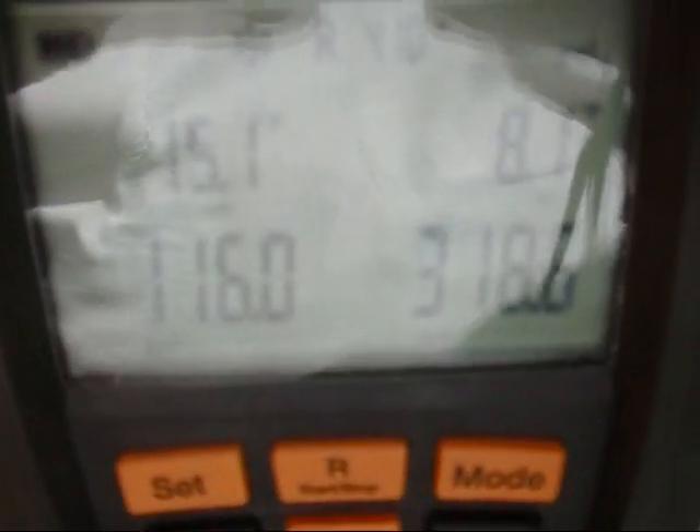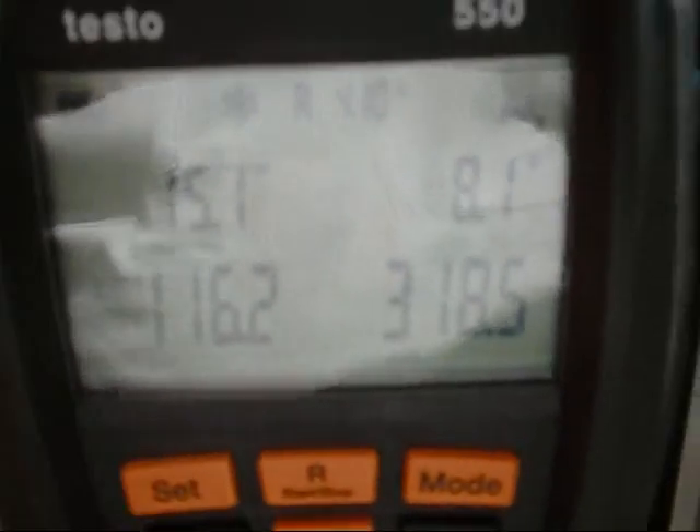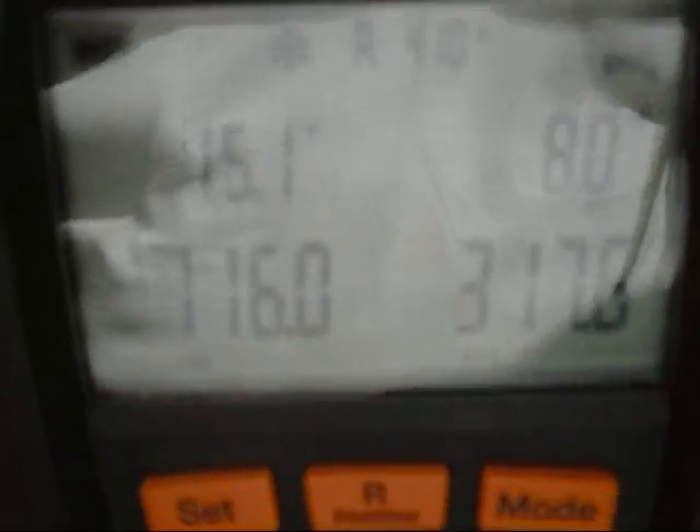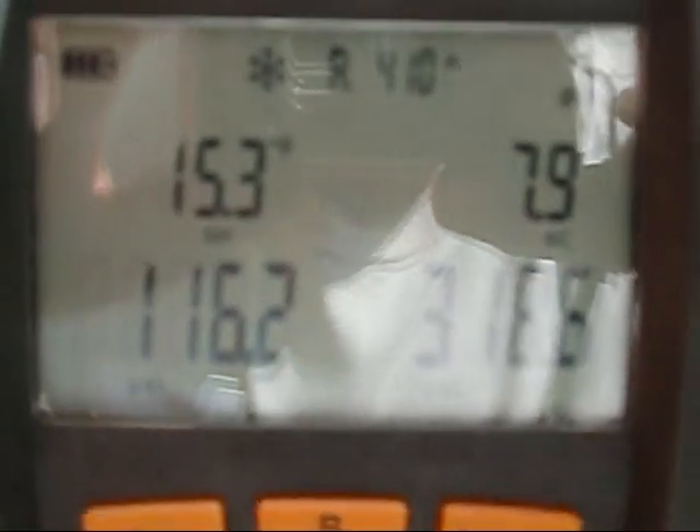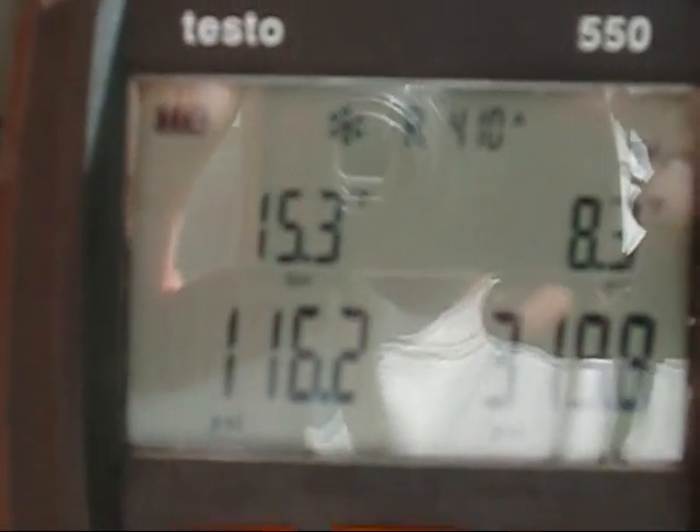While we're sitting here, I've just been letting her run, and she's already up to like 8.1. She's throttling with the TXV — 8.0 — and roughly my superheat is 15. That's about 7 degrees apart, and that is super. However, the manufacturer calls for 9 degrees subcooling, so I'm just going to add a little taste of refrigerant. This R-410A will get away from you, so you've just got to throttle just a little bit in.